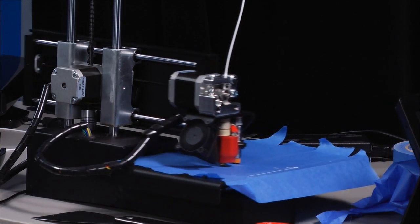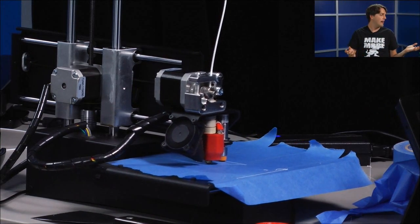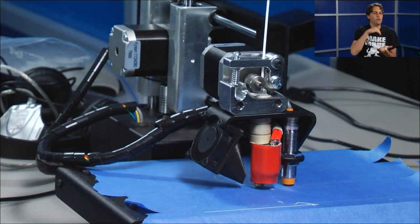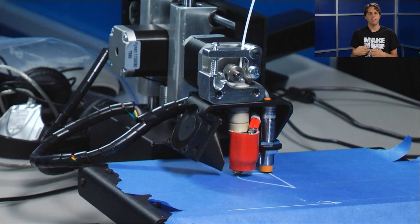Slicing is a very complex process because there's an infinite number of ways you could do it for any given 3D object. A very simple approach would be to raster back and forth like a lawnmower on every layer — technically that would create the 3D shape, but you'd get little nubbins at every turn and a very rough outer surface. We've tried to make this higher quality — for instance, you can see here it's printing the perimeters first, creating nice smooth outer edges that represent the outside of the shape, and then doing the raster infill afterwards, which is hidden internally.